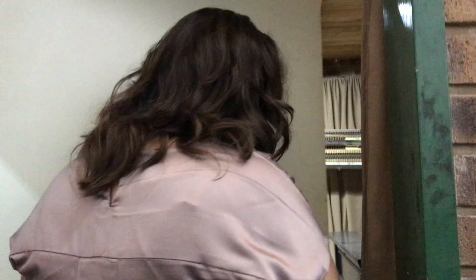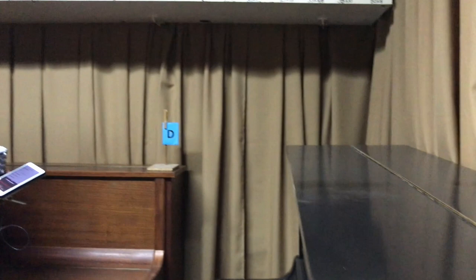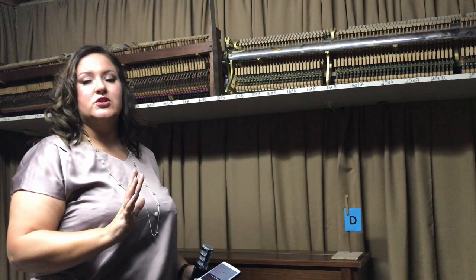Now we are at the tuning room — it's a bit more silent and condensed in sound. KG does the final tunings for the upright pianos and also attends most of our university and theatre tunings when others aren't available. Currently in the room we have three pianos. This one was fully restored — the client brought it to us literally in pieces. The hammerheads were in one box, the keys scattered into different boxes, strings non-existent, and some parts the client had tried to sand down and paint himself.